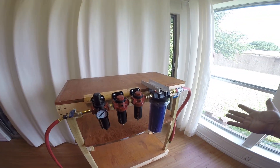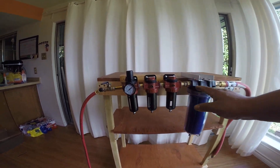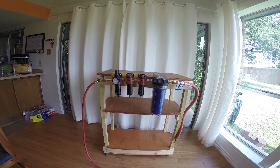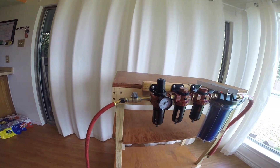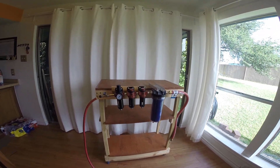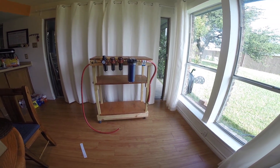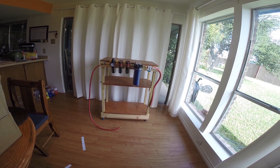I'm thinking this is probably going to manage all my water problems. Looks pretty good. You can probably see there's an arch here — it's from coupler to coupler, it arced a little bit. I wanted my least amount of tension on this right here. Well, there you go — there's your DIY desiccant filter system: 40 micron filter, 5 micron filter, 0.01 micron filter, and your desiccant beads. Hope you enjoyed this video. I'll have more to come pretty soon. Take care.